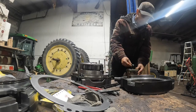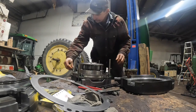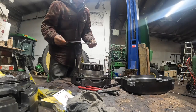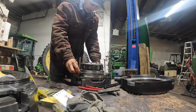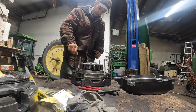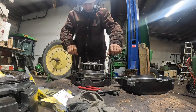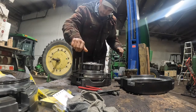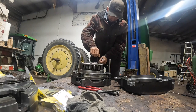I'm just really careful. Basically all it's doing is keeping your return springs for your plates lined up, so the bolts will go back through it when you finish the assembly, which we're not going to be able to finish anyway because we don't have all the parts. Just get it most of the way together that we possibly can. Anyway, here's our return plate. They're going to be the far holes, like so. It goes on there just like that. And we've got 2 of our bolts here to line everything back up. So those are lining up. Be very, very careful. Okay, so all that's lining up.